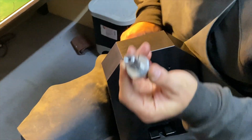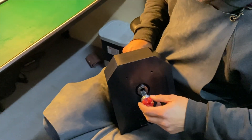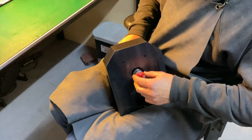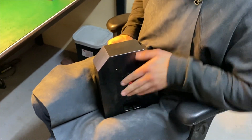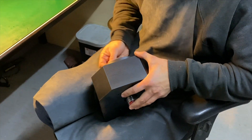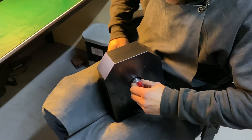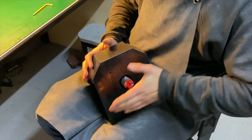This spline shaft was cut on the fourth axis — I have a short video on my page showing how it was cut. And it fits perfectly into the spline shaft of the harmonic drive. So now I'm gonna tighten it down from the front to make sure they stay in place. It doesn't come off.